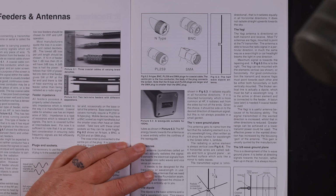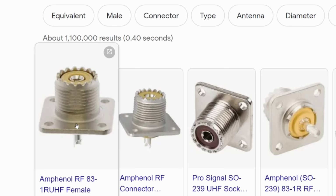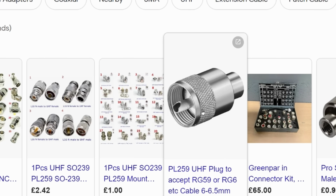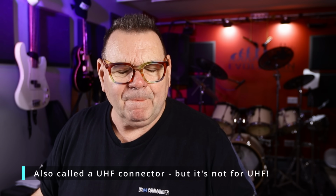And we've got connectors. The average HF set, high frequency, shortwave, the long distance skip-hoppy stuff, normally has something called an SO239 on the back of it, and that's an SO239 there. Therefore, to attach a socket to that, we need a PL259. Most of the time, a PL259, it kind of looks like this one here, is adequate, right up to a good one, because there are really crappy PL259s and most exceptional PL259s. So you just need to be careful when you buy.